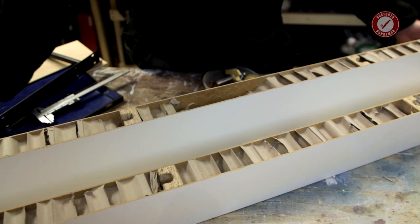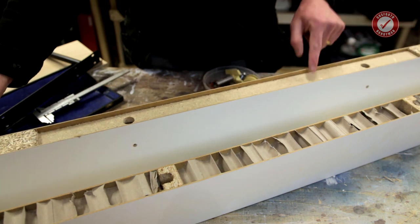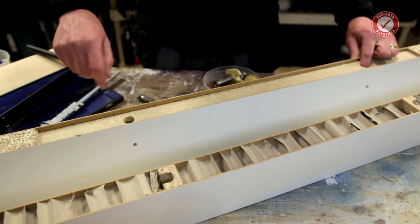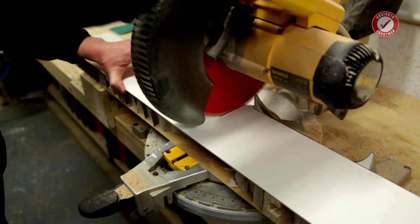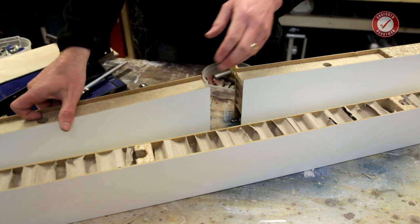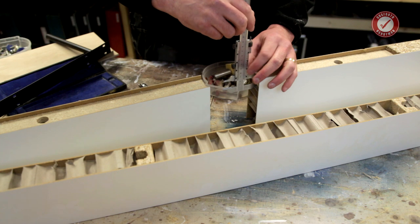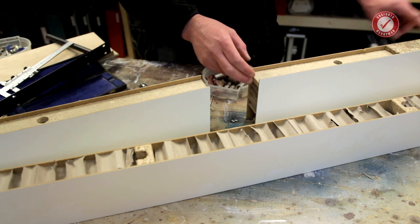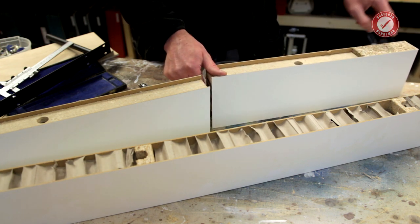That's the back. On the back side of it, we have a strip of chipboard. I can't really get the calipers in, I would have to chop this in half. Let's chop this in half. What we've got there for the back bit is — looks thicker than 12mm — pretty much bang on 12.5mm. So 12.5mm chipboard on the back. We've got this little reinforcing block thing here — I'll need to smash another piece out to find out how big that is.